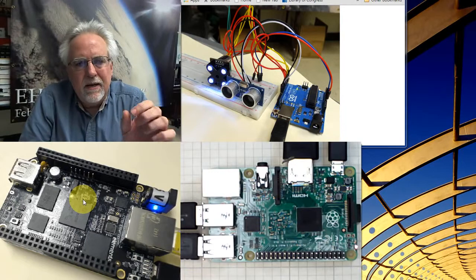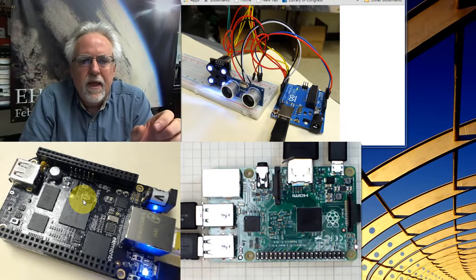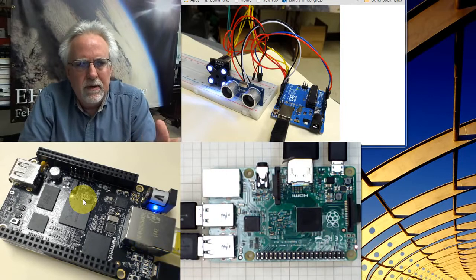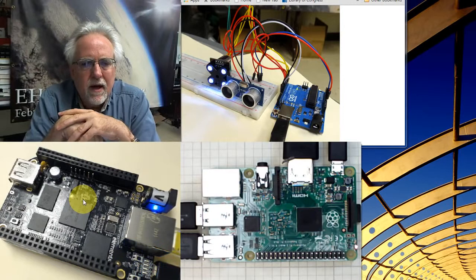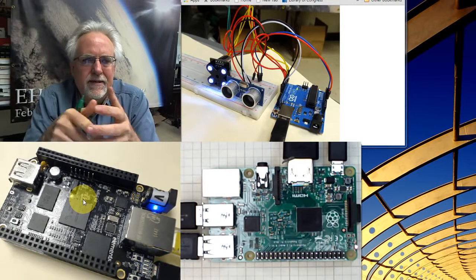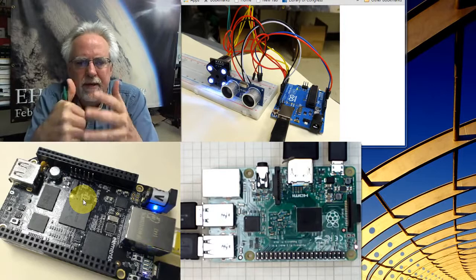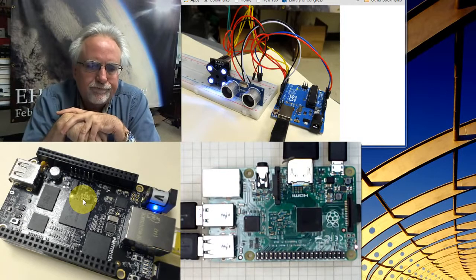Now you could get an A to D converter, and then you could use that A to D converter as a chip in your project to read analog values, convert them to digital, maybe come in through the I2C pins, but I don't want to do that. It's just like, give me something easy to use. Give me some analog pins on the Raspberry Pi, but that's sort of where it shuts you down.